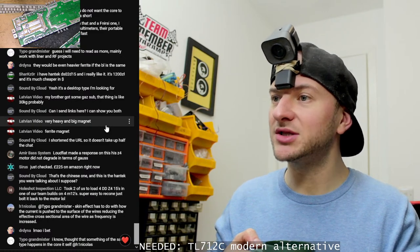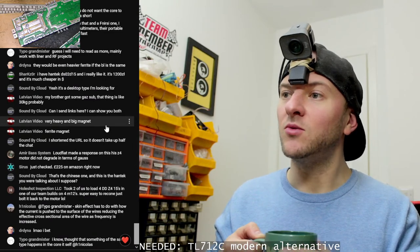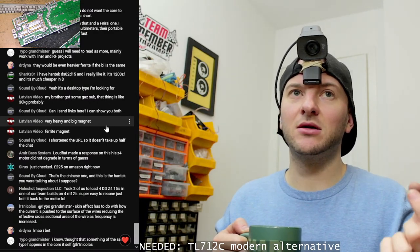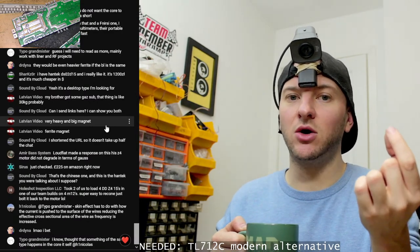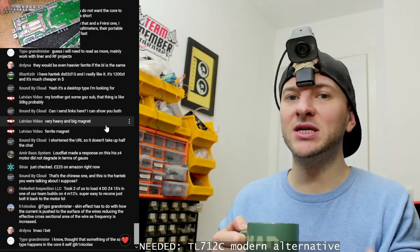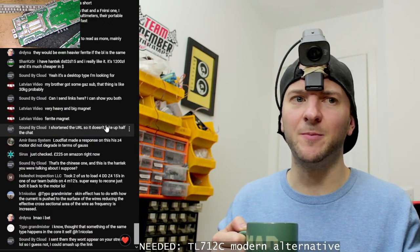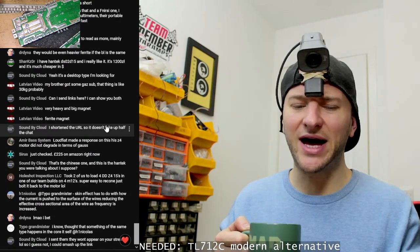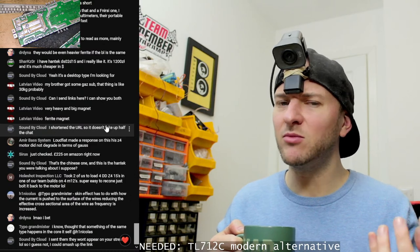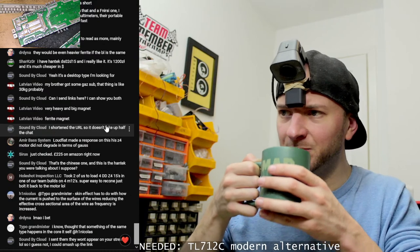His Z4 motor did not degrade in terms of gauss. That's really cool to know. Okay, cool. Well, I know with the Z4 motors, the actual Neo part is kind of their little slugs on the pillars. So it would be a bit different if the pole piece itself was Neo. I don't know if even that exists. Doesn't the Rockford Fosgate big 21-inch woofer have a Neo pole piece? Am I right? I could be wrong. But that would maybe be more susceptible to getting to ridiculously high temperatures where it would get affected, but...